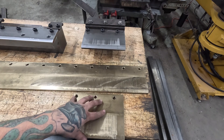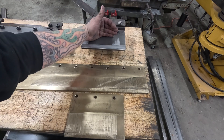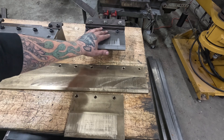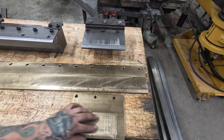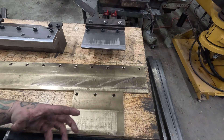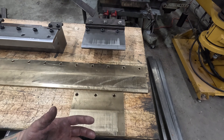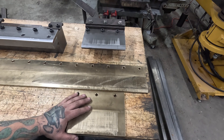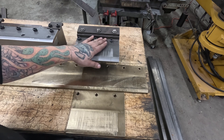Hardway bending going from 2x4 to 2x3 was relatively easy because you're only having to adjust the clamp die and the pressure die over one more inch to compensate from going from 4 inch to 3 inch. The machine is able to be adjusted to do that, but the problem you run into is your wear plates made out of aluminum bronze — they're an inch too long. I was trying to be budget friendly and didn't want to buy big pieces of aluminum bronze due to its overall cost. I figured I would do a proof of concept, some testing, and test the waters to make sure there was actually a good market for bending 2x3 120 wall.